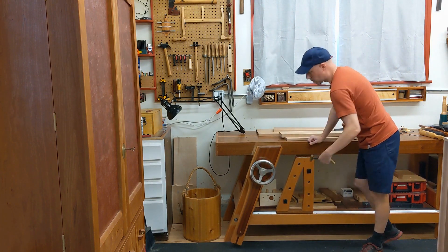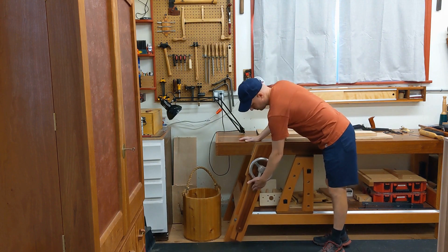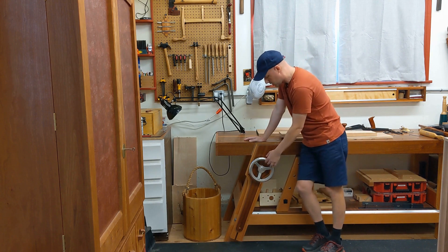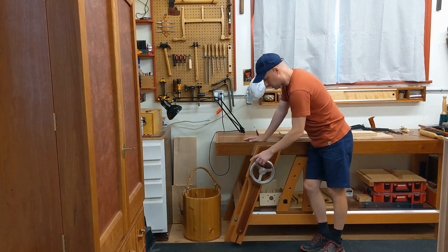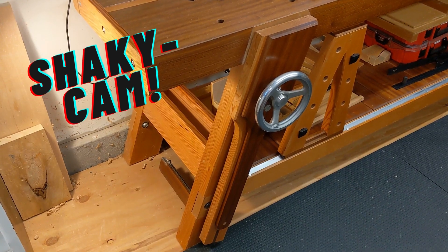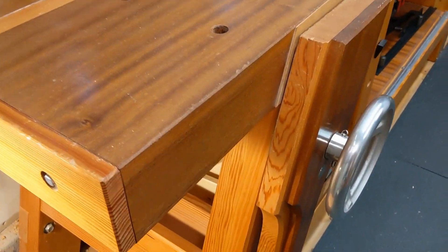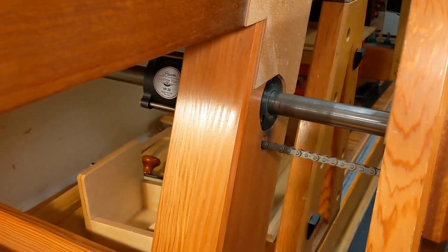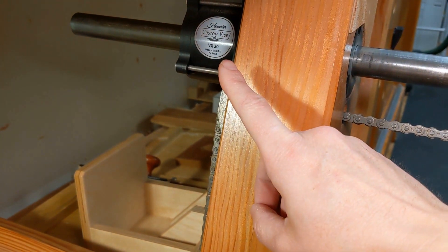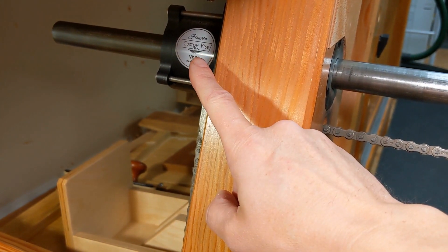You may have noticed that this particular vise works like a quick-release vise. I'm going to bring the camera over so you can see what this hardware looks like, because it is quite unusual. This is how you'll notice there's no screw here, no threading — this is a smooth shaft. This is a custom leg vise from Hovarter Custom Vise, the VX20, and the way it works is there's what they call a slip clutch back here. That mechanism is similar to what you'd see on an F-style clamp. I bring it in, give it about a half turn, and I am good and tight.